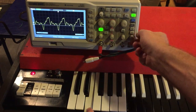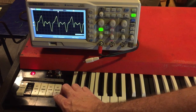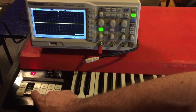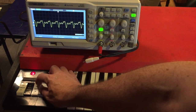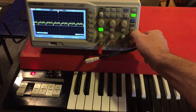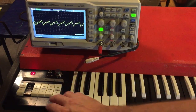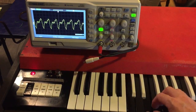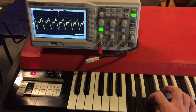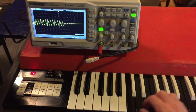Adding a little flavor with the flute gives a more complex waveform. Here's the bright stop, then re-triggering — there we go. Now brass, and the mellow. Going up an octave to an E — with everything, then flute only, bright only, brass and mellow, and of course all together. The amplitude is lower at higher notes, but it doesn't really sound any louder or quieter — it just has to do with the way the speakers and our ears respond.